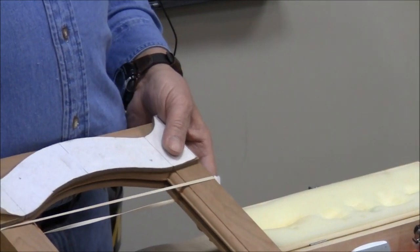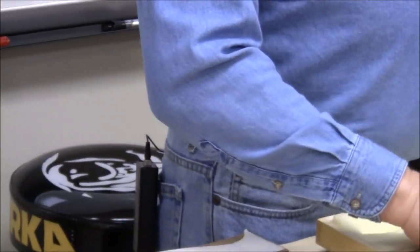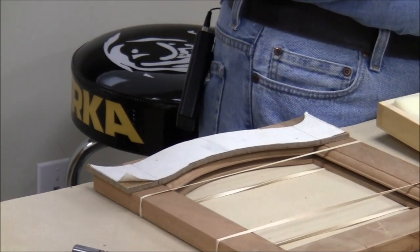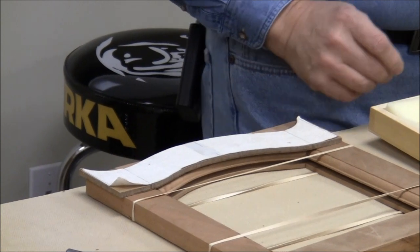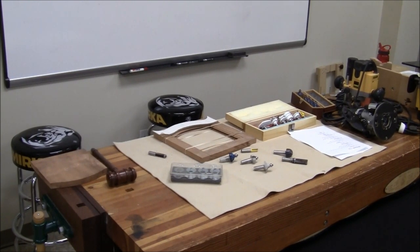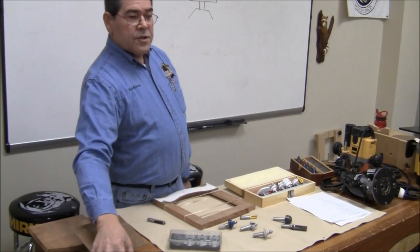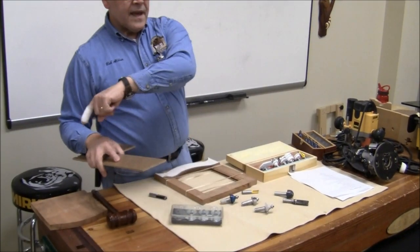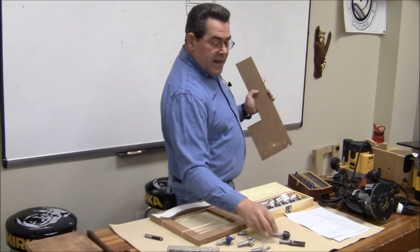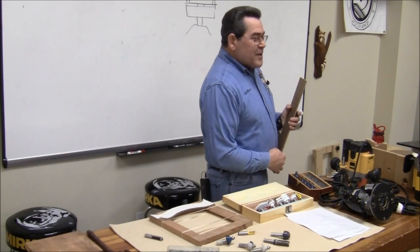Generally you're going to do this on a router table, though it's perfectly feasible to do it handheld and sometimes you do. I had some round-over templates I created specifically for making round corners on tabletops — nothing more than a piece of Masonite with the corner cut round. Double-stick tape that to your corner, and you can use the router to cut that right off. You can genuinely cut with the larger horsepowers and the bigger bits. I can go through a three-quarter-inch piece of wood no problem — it's like a table saw, there's no arguing with three horsepower.